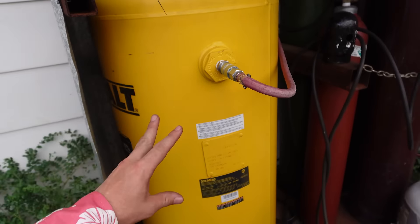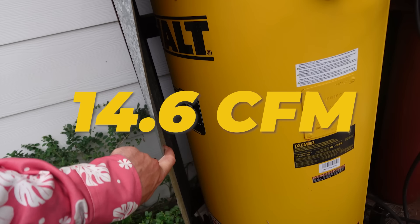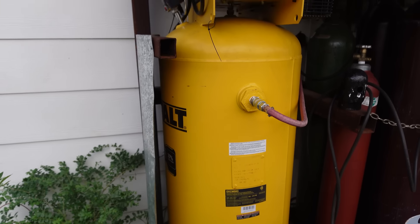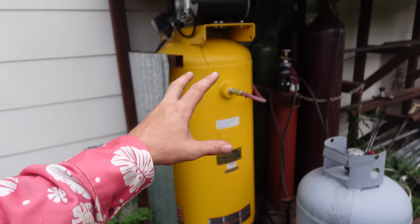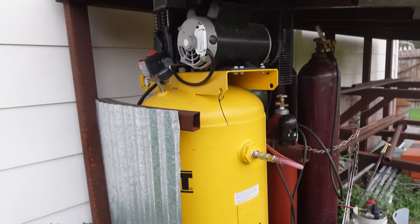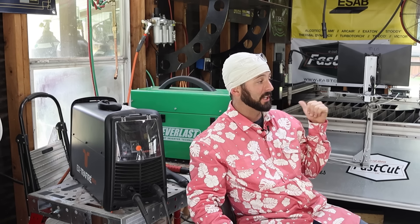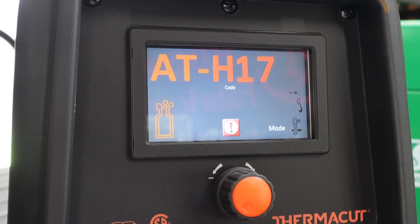In the back of my shop I've got a 60-gallon compressor as well. Based on reviews, the one I got outputs 14.6 CFM at 145 to 175 PSI — definitely plenty. I always wanted more than I needed, which is why I went with this setup. I used a machine similar to the Hurricane for CNC cutting and was able to run continuously. I'd hit the duty cycle on the machine before ever hitting an air error code. Having more than enough makes for better, more consistent cuts.